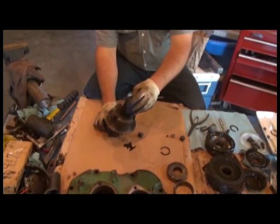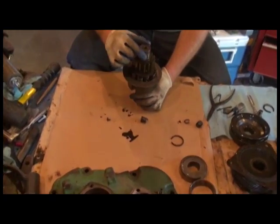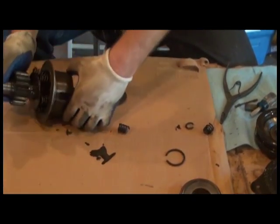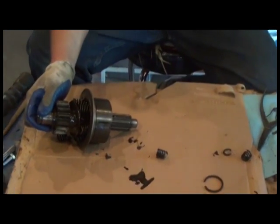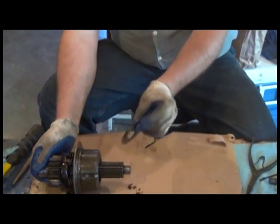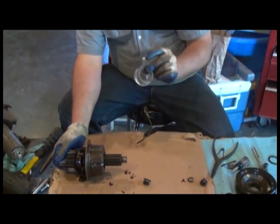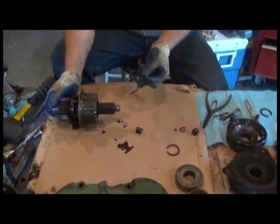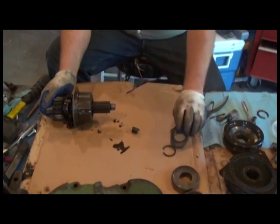We're back to the workbench. Now it's time to see what surprises might wait in store for us inside the clutch and the cam assembly. Something very important that the book notes is to notice the very thick top washer that comes off right by the cam. It's a hardened washer. We've got to make sure to reinstall it there because the shims underneath it are not hard, and over time, if they were installed reversed, the shims would actually disintegrate from the snap ring and just vibrations. So take care that you don't lose these.